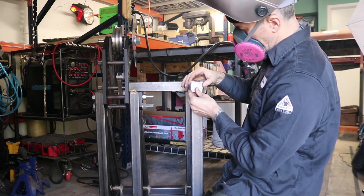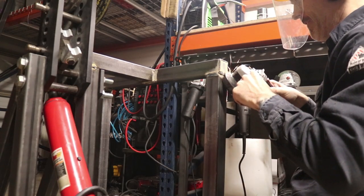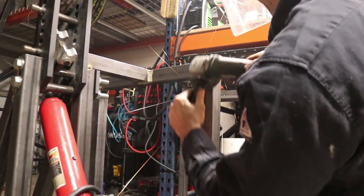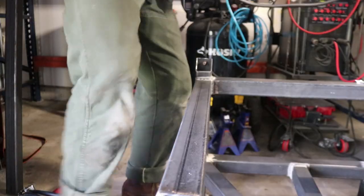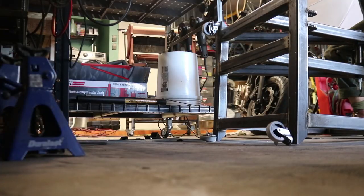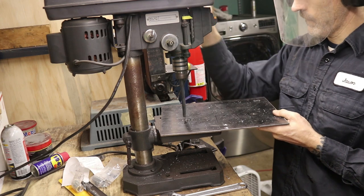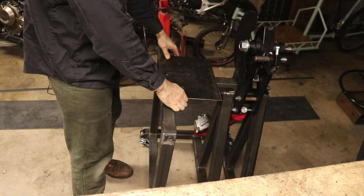I've cut out some sheet stock to make caps for the ends of these tubes. I weld this on, then I'm going to grind it off and use a flap disc to make it nice and smooth. Here I'm welding some nuts to the bottom of the legs so that my casters can thread up through those nuts — this is what they call a captive nut. I've also drilled out some big holes in some leftover 3/16-inch plate to bolt the roller to, and we're going to weld this platform on and bolt the roller down.